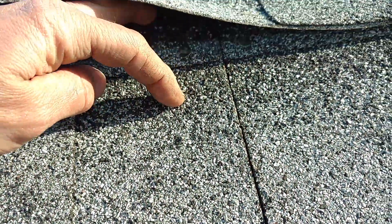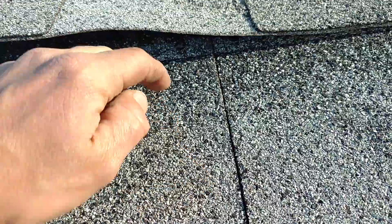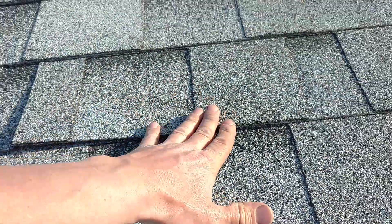On a hot summer day, this lower part heats up. It will not slide out because it is actually pinned through the fiberglass. So I hope this helps — don't overlook this. It's very important. You don't want a reputation a couple years later for putting a brand new, very expensive product on a roof and the workmanship being horrible, causing leaks, shingles heating up, sliding out, blowing out. I've actually pulled shingles for a shingle manufacturer and sent them in on a warranty claim before, and they deny it because the installation is horrible.